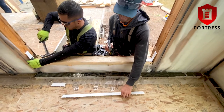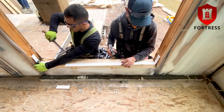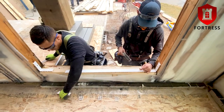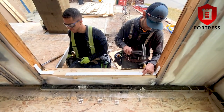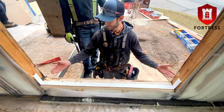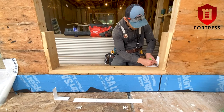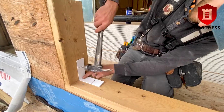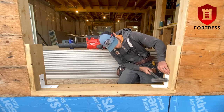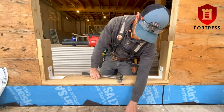Now you can place and fasten your sloped center strip square and aligned with one of the corners. Because the system is sloped on the sill and sides of the corners downward and outwards, it ensures that the moisture will always exit to the outside and not inside. In a 2x6 or larger wall construction it is the same as a 2x4 wall construction, except the application is from the inside edge of the wall in the sill area.